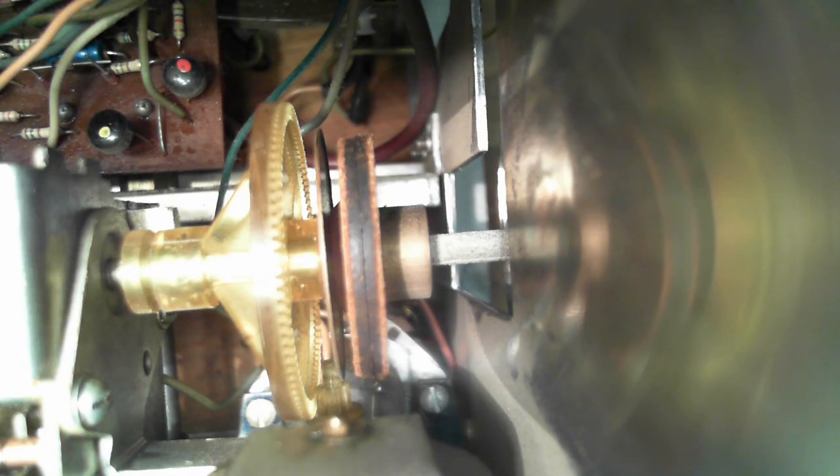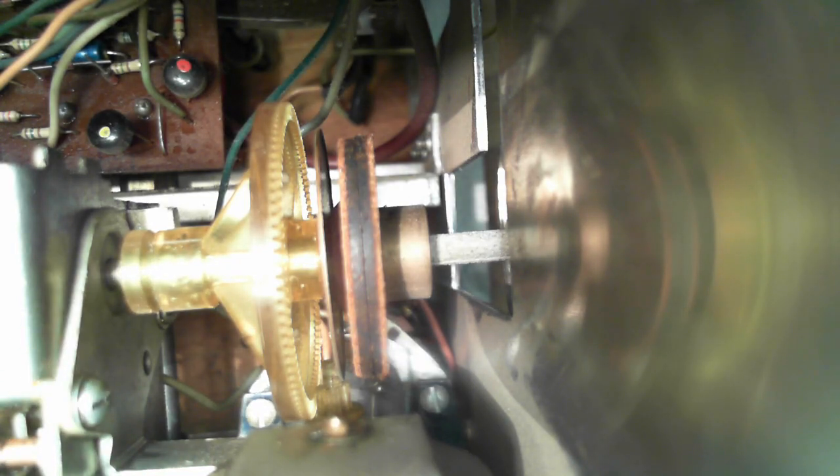In that case, now that metal plate has a dual purpose. One is it's holding the two plastic gears together, the yellow gears, and it's also, because it's pushing on the knob shaft, that's crazy, it applies a spring pressure against the clutch. So I think the spring pressure on the clutch would come from the finger way back here, because there's just insufficient pressure. Okay, I've already done this. I've raised the pressure. It didn't help. Try it again. Okay, so we assume that there's insufficient pressure.